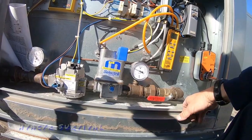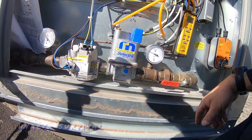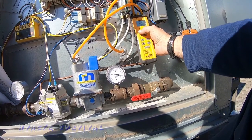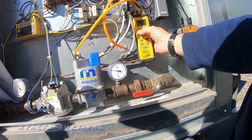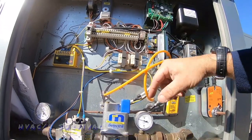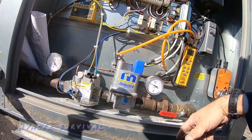This must have a VFD on it — it came up really slow airflow-wise. We're at 0.24 differential, with 0.18 and 0.42 on our two different switches. Technically it should be closing according to this, but the airflow switch is not — and it may not be calling either. I need to go downstairs and see where they have things set.